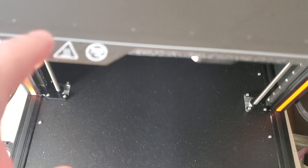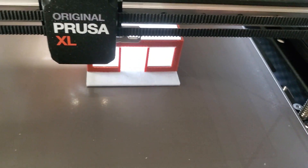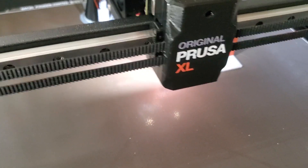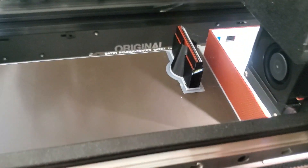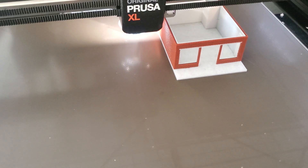I'm really happy with this print bed. I'm not sure what it's coated with, but it works really well. I haven't had to use any glue stick yet. Unlike some other printers where you'd have to use glue stick or the corners would curl or come loose, this has had no problems. Everything I've printed so far has stayed stuck down and then pretty much pops right off when you let it cool. It's a powder coated sheet — it came with another one that's textured, though I'm not sure I'll ever use that.